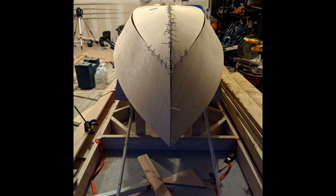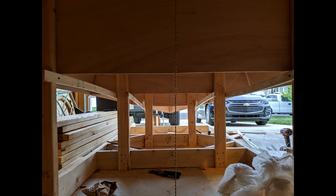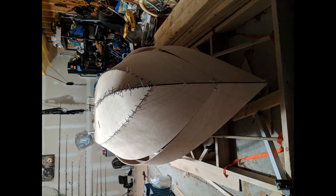I did have to use some extra wire ties as seen in this next photo, but you basically want this to sandwich down and get against the bulkhead and follow those curves or straight lines that are actually on the bulkhead. And you'll see as you keep building and building and building, all the layers work together and they start forming the hull of the boat.